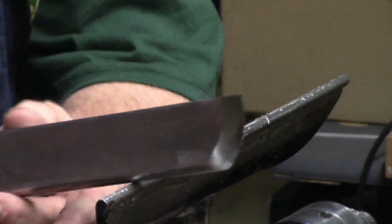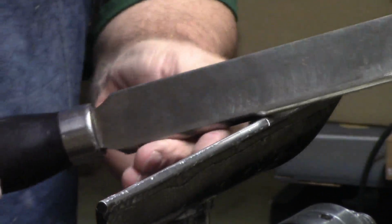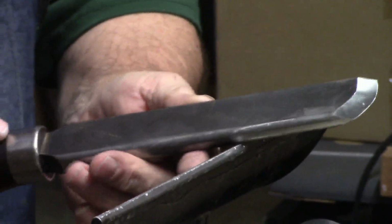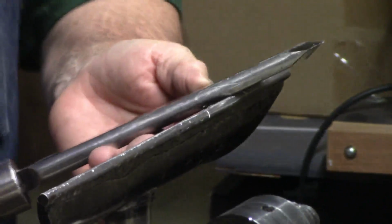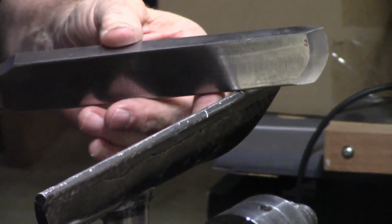Then the other thing I do is take some paraffin and wax it. And what I'm after is zero gravity. See that? Because this tool is a sports car. It's not a dump truck. It doesn't lumber along. Matter of fact, one of the hardest cuts with it, you've got to move it very quickly, the rotation. If it stutters, you're going to have trouble. Okay? So very important that the tool rest be clean.